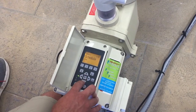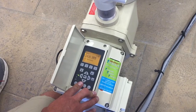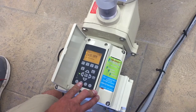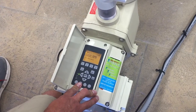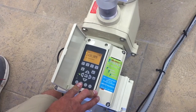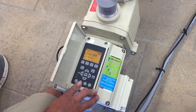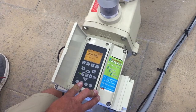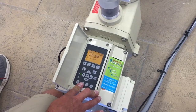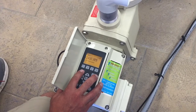Then I'm going to press the down arrow again. Now I get to set my RPMs. Your RPMs are going to be determined by what you would like this schedule to do. If you want this to be a cleaning RPM, you're going to be setting your range probably somewhere between 2,400 and 3,000 RPMs. If it's going to be purely a slow filtration range, you might be setting it somewhere between 1,300 to 1,900 RPMs. To change your RPMs, simply press the select button.